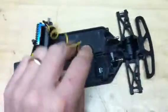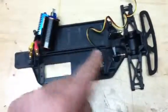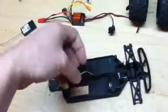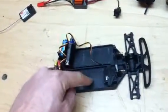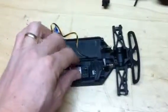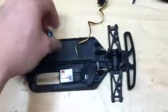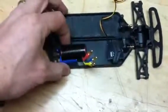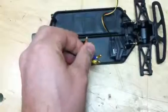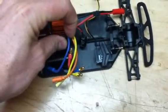I'm also going to cut this servo wire and shorten it so it goes right into the receiver — I'll leave a little coil but definitely not this long. That thing is long, so I'm going to cut it probably right about there, solder it shorter, do a little coil, and have it just drop right into the receiver. These wires for the motor will be right here and will just go right into the ESC, also right here. Shorten those wires and they'll go right in.